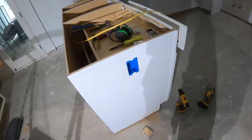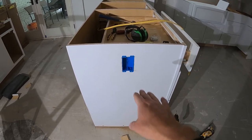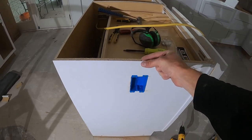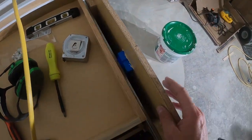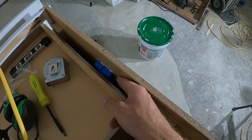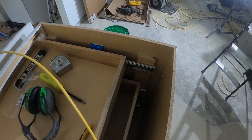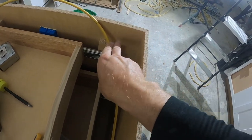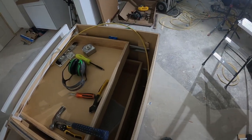So we've got our box. I just centered it on this cabinet and dropped it down two or three inches. Just remember there will be a little overhang for the countertop, so you don't want it right up against the top. With this box you don't have to worry about exactly where it goes — it fits between the drawer slides and the cabinet at any spot you put it. And with our wire, we can just run it right up over the top of this and then down into the box, so that won't be an issue. Let's get that wire in and we'll be done with this project.